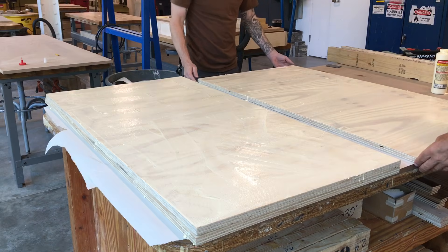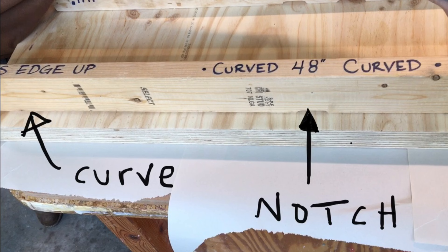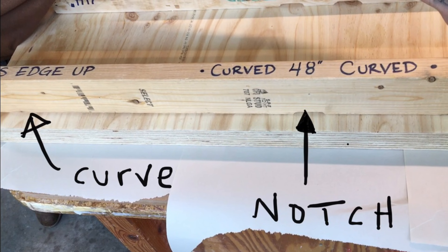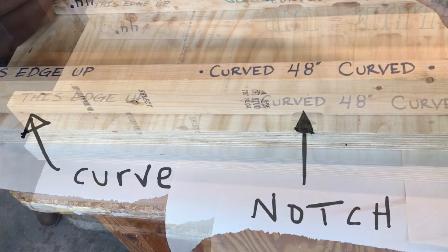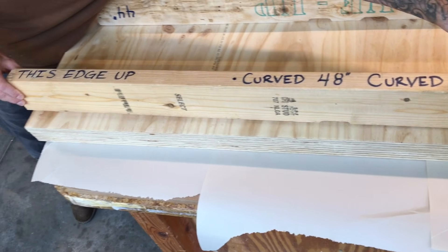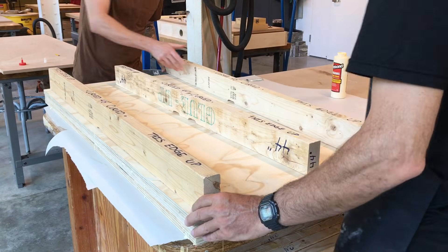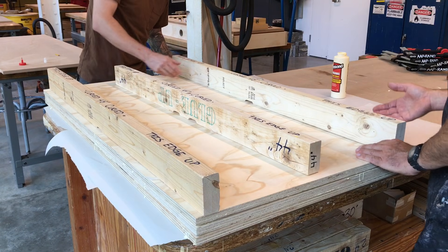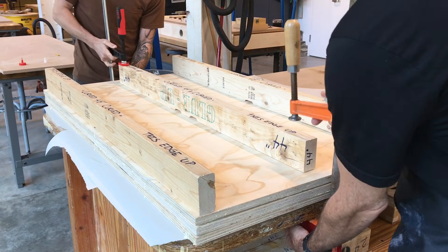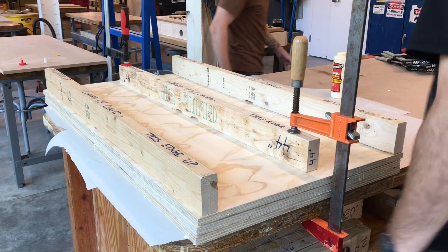Many of our clamping boards have an arc on the bottom surface and shim notches in order to help ensure both center of material clamping pressure as well as edge pressure. After you have spread your glue and have the pieces stacked, use the clamping boards to both spread the clamping force over a larger area and to protect your material from the clamps crushing it. When setting up your clamps, put them on just snug enough to stay in place until all the clamps you need are in place.